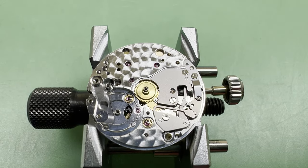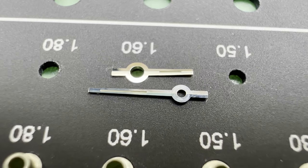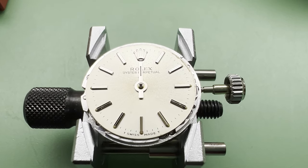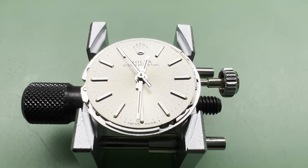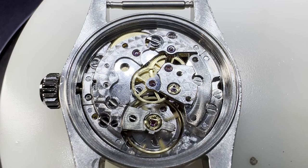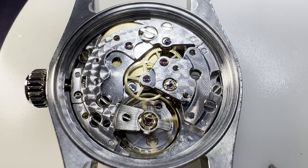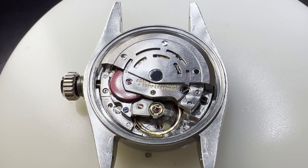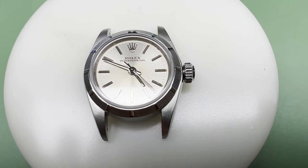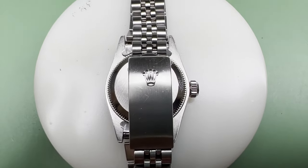The hour wheel can be put back on. The dial indices and crown on the dial are gently buffed before being put back on the movement. The hands are buffed too — you can see the difference between the buffed hour hand and the unbuffed minute hand. The hour hand is put on, then the minutes hand, and the seconds hand. The crown is removed, allowing the movement to be recased. The crown is then put back in, and the case clamps are tightened to grip the walls of the case and stop the movement from moving. Then the automatic works can be reattached and tested. The case is given a final check to make sure everything is spotless, and then the case back is put on tight. The watch just needs its bracelet. And there we go — one fully serviced and refinished Rolex Oyster Perpetual.